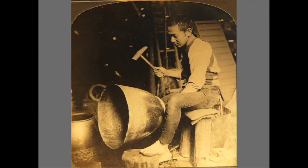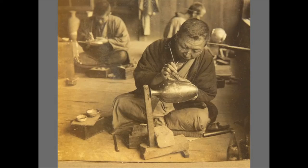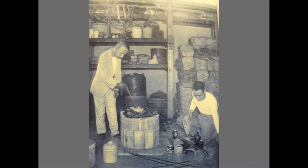The Japanese basic process of making cloisonné on metal, which I think all of you probably know, can be followed in photographs produced circa 1900. First, the substrate is created. When that substrate is ready, the design is drawn on it. Then flattened wires are individually cut to size, formed into the correct shape, and glued on edge to the metal surface. The piece is fired for the first time to permanently affix the wires.